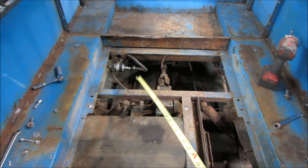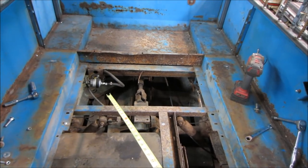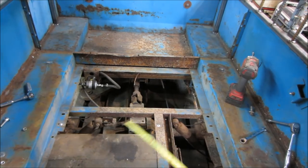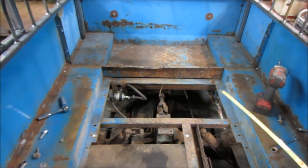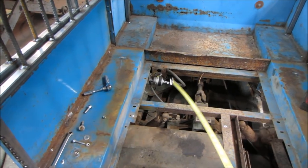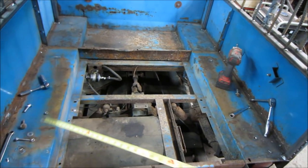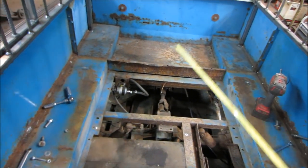Metal, I just went measuring in the welding trailer, the steel that I have, and the one sheet that I cut up the most was the 14 gauge, which got used on this in a few spots. And I do not have a piece that is long enough to go from there all the way to the front. So I think what I'm going to do is bend that lip over this way, and the two pieces I already have cut, those two pieces that are already meant to fit up here, I think I'm just going to slice them down, and we'll make it so that they fit just in this section, and we'll leave the rabbit piece in the front.